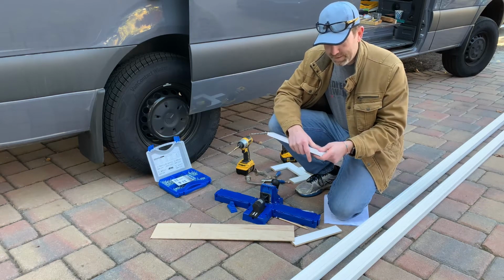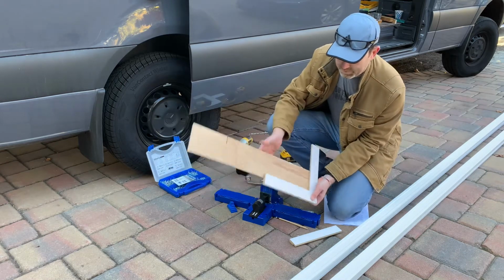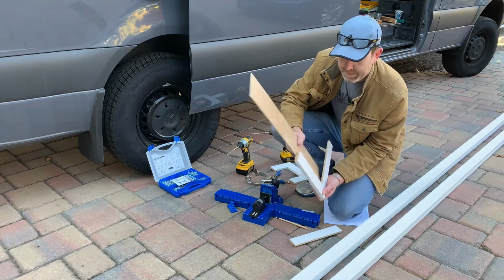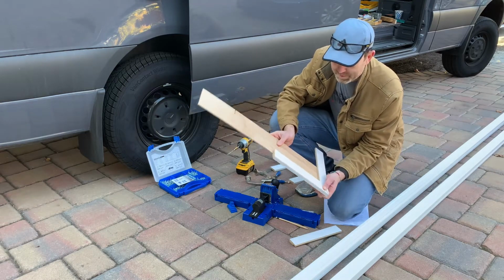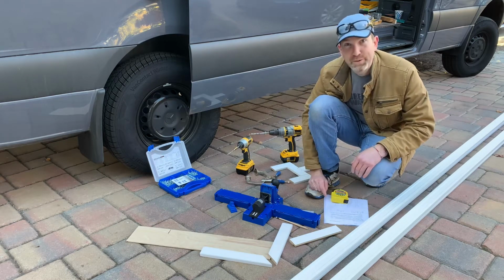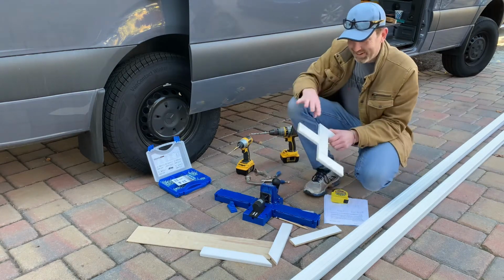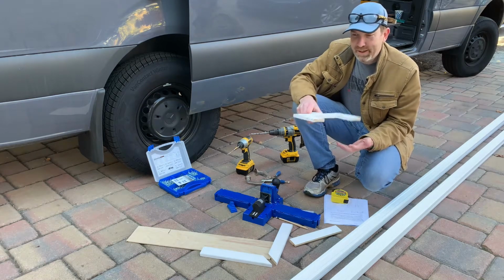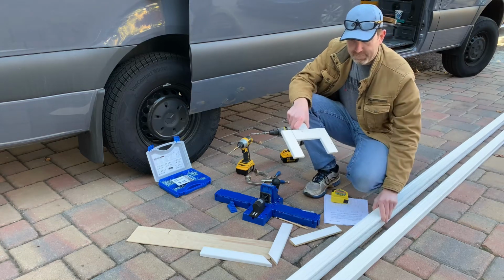So just from a visual standpoint, it's going to look like this. This is 1/2-inch trim or baseboard, and I routed it, or cut this piece off, so I could get the 1/4 inch in it. However, I'm going to do something a lot easier than 45-degree corner joints. I'm going to use my Kreg Jig because I liked it so much. I found a video by them on how to make cabinet doors, and you can see it's really strong. So I'm going to use my 1/2-inch.